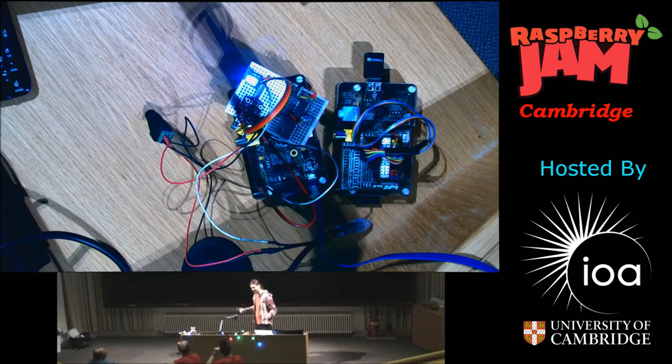There's also the single-board field-programmable gate array — I'm not going to try and explain that concept right now because it will break my brain and yours. But in the simplest, quickest possible way, it's programmable hardware. You can write code that will physically change the layout of the hardware by making connections using electricity. You can pick one up, program it, and say 'you're an Arduino' — and it will become an Arduino for all intents and purposes. Or you can say 'you're a signal processor for telecom communications' and it will become that. If you want to step up from a programmable microcontroller and actually start physically affecting the hardware and designing layouts, you can do that in a similar way to the Arduino.